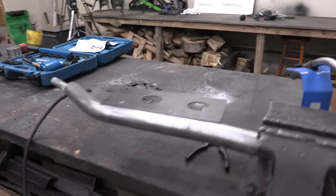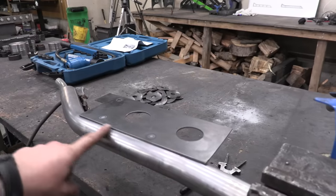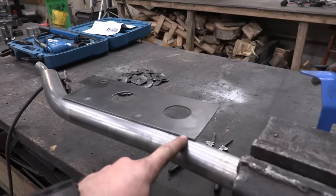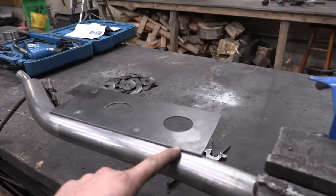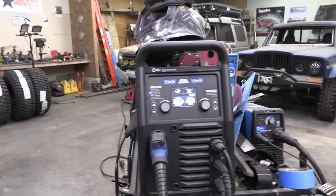The next thing we're going to work on is welding. Since all my welds are going to be exposed, I want to put in a little bit of practice on the exact size and type of material that I'm going to be welding. I want to experiment with a technique I've done on a few other projects that looks really nice — you do a little spot weld, go over it and stop, go over it and stop, working your way down. It'll start to look like a stack of dimes. I'm going to practice on a scrap piece to set the machine up correctly before applying this technique on the piece we're building.